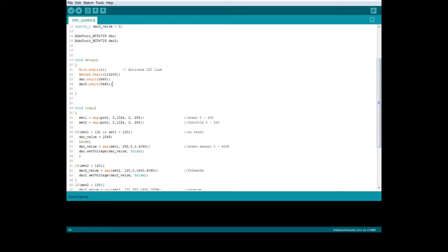This is a very important thing I forgot to mention earlier: the DACs are I2C and they both have the same address when you get them new. There is a little bridge connector on them — you just solder the pins together and that changes the address. If you don't do it, they're both going to be 0x60, so make sure that you do that. It's really, really important.